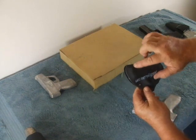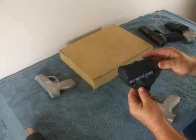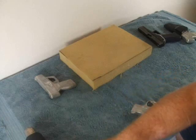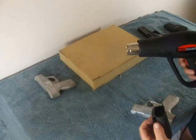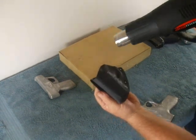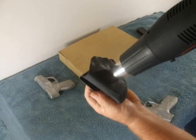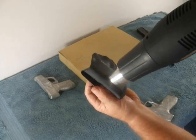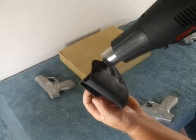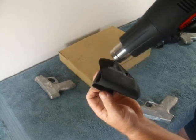The next thing we're going to do is warm this up in a circle and soften it. This material is made to be thermally formed, so that's no big deal. You can use a hair dryer or a heat gun — this happens to be a $12 heat gun from Harbor Freight. Just warm it up in a circle, keep moving, don't stay in one place. This takes on average 20 to 30 seconds and you'll start seeing it get soft pretty quick.